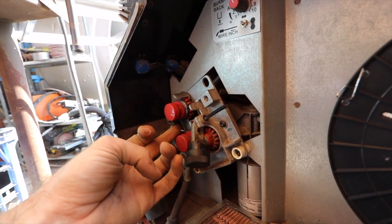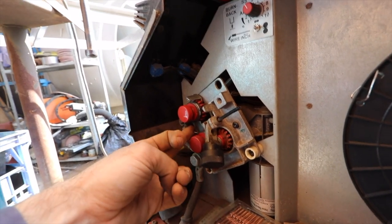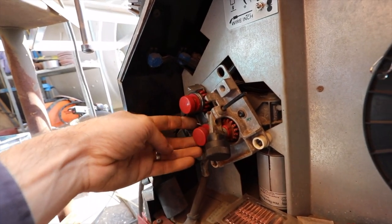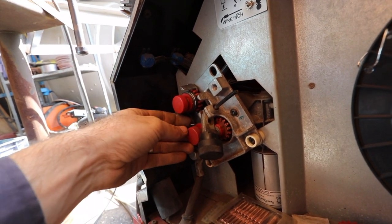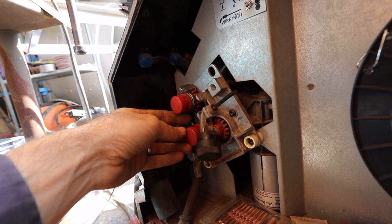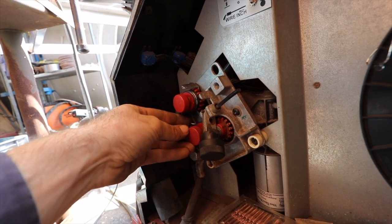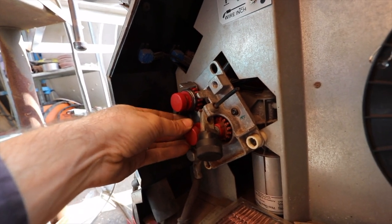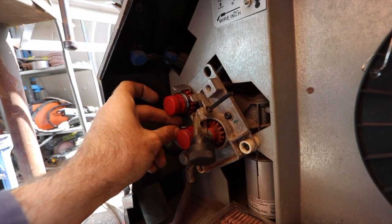The common solution is to use a spool gun, where you don't have any wire coming from the machine, it's all up at the gun end, and you have a little 1 kg or half kg reel of wire that spools out and only has to travel about 10-12 inches before it's at the MIG head. My welder is too old. I physically can't get a spool gun onto this. So if you're thinking, why don't you just buy a spool gun?